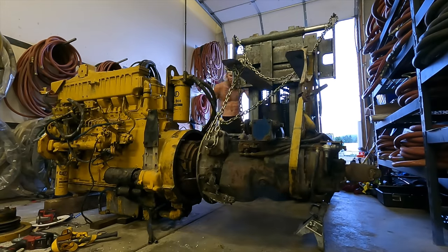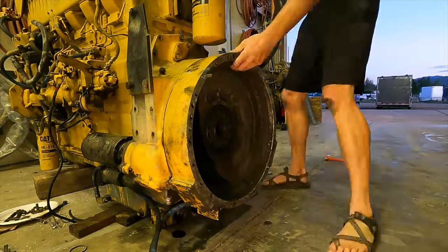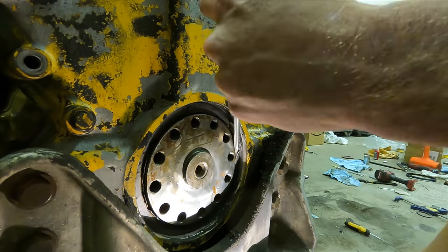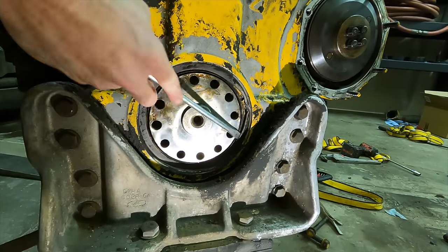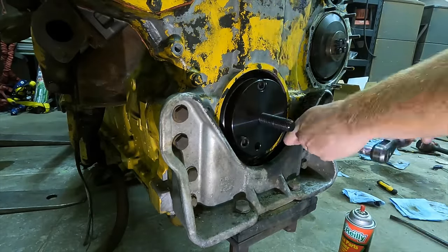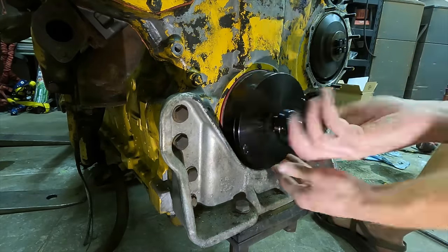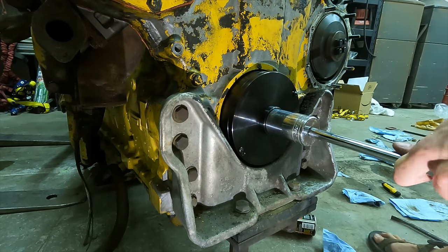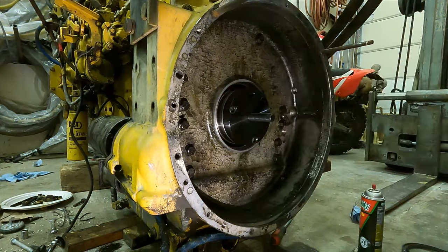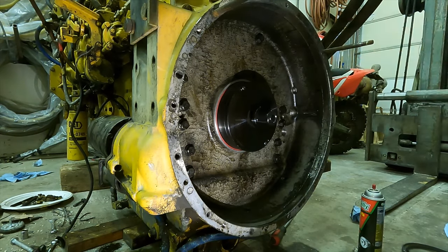Let's yank the transmission off, then the clutch, the oil pipes, the secondary flywheel, and probably the whole brake saver. You can see the same gap on the rear main seal too. Back at the front of the engine, I use screwdrivers to gently massage the original seal out, clean the surface, and install the first part of the special tool that aligns the seal and sleeve. Once that's bolted on, I put retaining compound on the wear sleeve. Then the second piece goes on the end, and I tighten a big nut that pushes the whole sleeve and seal in at one time — perfect result.